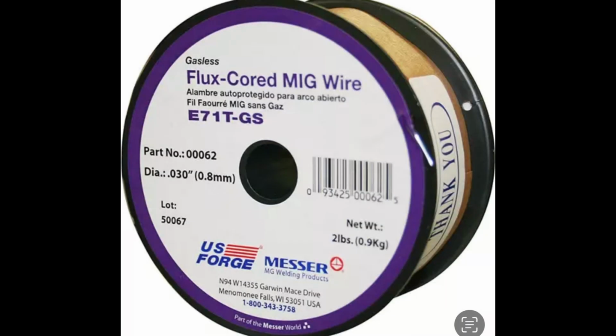This is the wire I'm using. It's just E71T-GS. This is not suitable for multiple pass, so multiple layers. It's .030. Keep in mind, you must run this with your MIG gun on DCEN. If you have your MIG gun on the positive, like when you use normal MIG wire and gas, it's not going to weld properly. All flux core is welded electrode negative on the gun. So let's get to doing some welding.